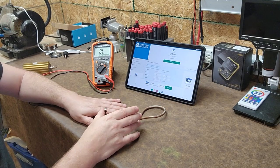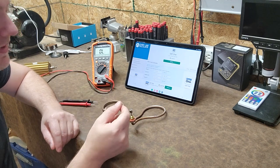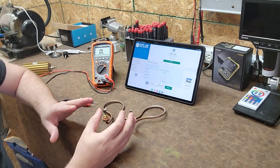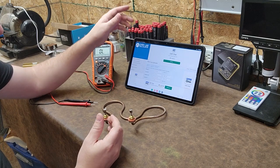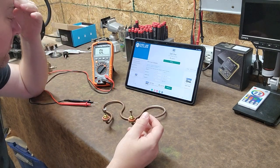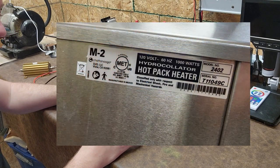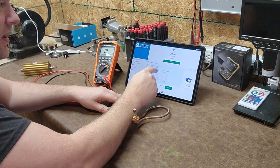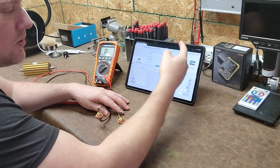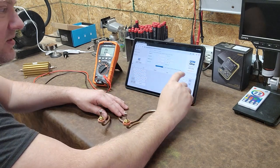Heating elements are all-on or all-off. On your device, look at the data sticker on the back — it'll tell you how many watts the device uses or the amount of amps. Using that, you can go into an Ohm's law calculator, which I have pulled up here — I'll leave a link in the video description. This device is a 120-volt device and it burns 1,000 watts, so let's type that in: voltage 120 volts, power 1,000 watts.